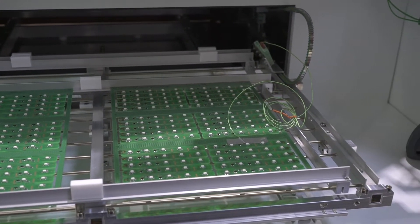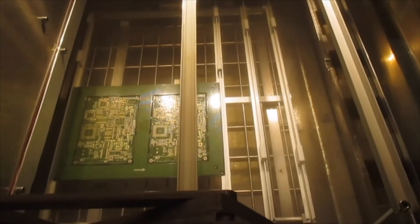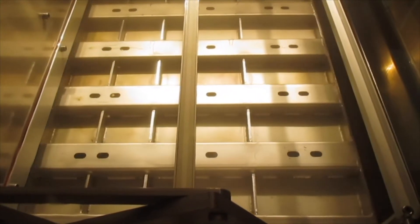It's a fairly unique process — you take it into the chamber, bring it up through a couple of phases to peak reflow, then slide the vacuum chamber across and evacuate the air. It's a fairly fast system. The cycle time for a complete workpiece carrier, which captures a few PCBs, is six minutes. Last year we released a new inline system, the XI series, which has two workpiece carriers circulating. While one carrier is in the cooling zone, the machine is already processing the next carrier.